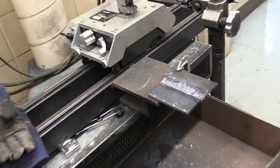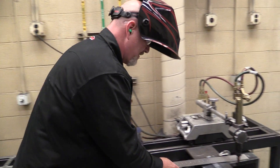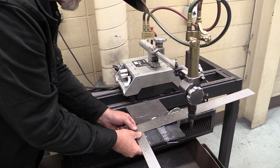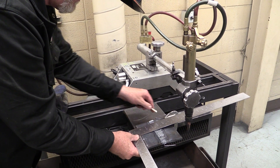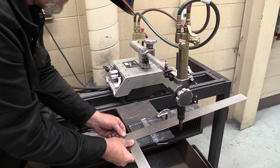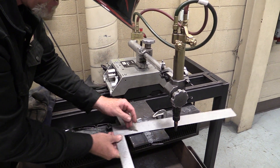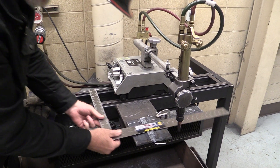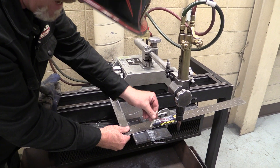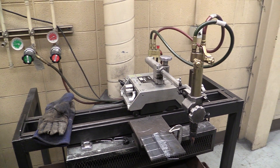You're going to go all the way across with those. You don't necessarily need to mark these out to show each cut — I'm only going to show you a couple of them. I'm going to come in with my square. Being as the line burner is straight and cuts straight, I really only need a guide. I don't need to know exactly where these things are because this line burner cuts straight — I really just need the starting point. If I cut that much, the rest of it's going to be straight. So we'll just come in here and make a little bit of a reference line.